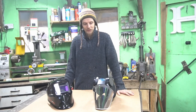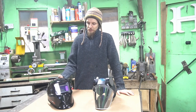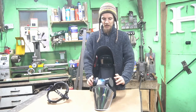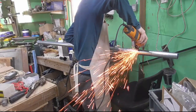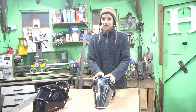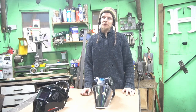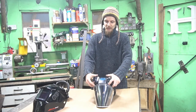The one problem with it when grinding is that I'm often doing a lot of welding as well, so I want to fit a welding mask over the front. Obviously I don't need it all the time so it has to be easily removed. I'm aware that these filters aren't rated for welding gases — they're just particulate filters — but when you're doing loads of grinding and then welding immediately afterwards, there's still a lot of fine metal particulates in the air. So even if I can just protect myself against those, I'm happy to continue welding with the doors open and a fan running.